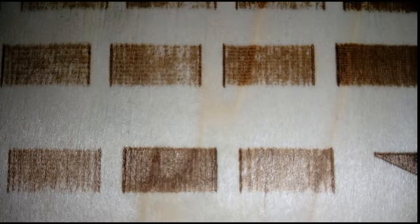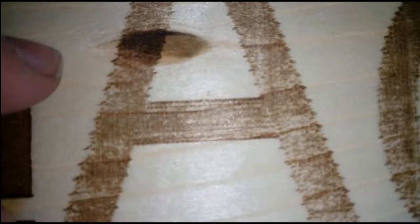This is a burn pattern — you can see that at the beginning and end of the laser burns there's a dark mark. That's because of the acceleration and deceleration of the head, so the laser actually spends more time there. This picture shows a modification I made to the software so it doesn't have as much acceleration — you can see more clearly where the head accelerates and decelerates, causing it to overburn.